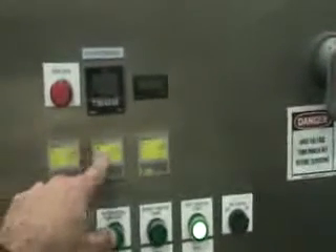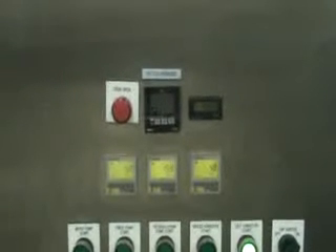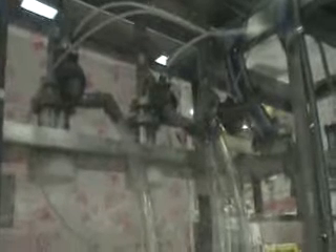The capped bottles move on to the gravity roller conveyor, with a stop at the end so they don't fall off the floor. One thing I neglected to show you are the three bottle counters. These counters can be set to arbitrary values, and the value placed into them determines how much water goes into the bottle. Those are independently set.